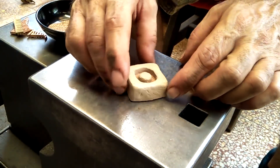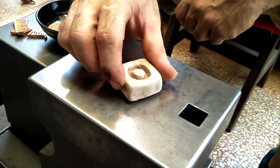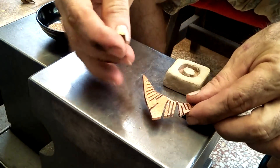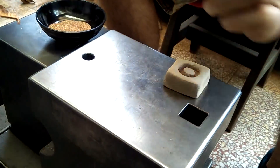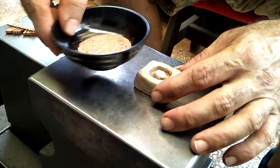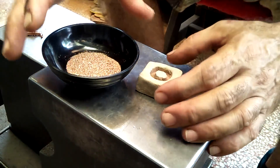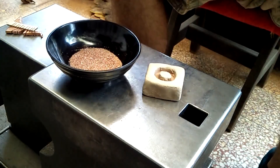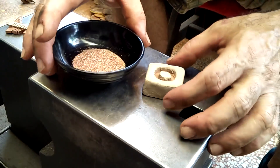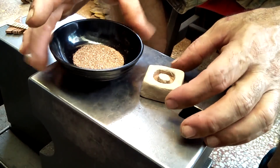Okay, so this is cool now. It's got one little fine crack here, but I think for this one-off use it'll just be fine. What I've done is hacksawed copper and also some brass, and I've got those granules here. I'll fill that in, get it into my forge, and see what happens. Why copper and brass? Why not — I figured I'd just mix them up. I also have an idea, if this works, to do something with non-ferrous and also steel pieces inside of there. But first things first, I want to cast this simple ring — let's see how this goes.